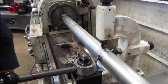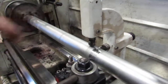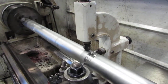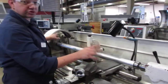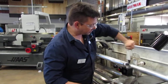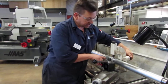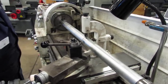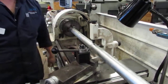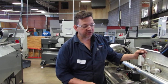I'm still a little bit out of round, but you can see now that my pipe is running through even though it's super thin walled. That's just a general idea of what I wanted to demonstrate. We do this a lot when we're turning long shafts or long thin pieces. I'll go ahead and back the support out on that — you can see the motion of the part picked back up. Thank you for watching. George Love, Texas State Technical College. This was an application of a following rest on a long bed lathe. Thank you.